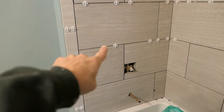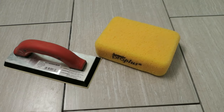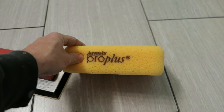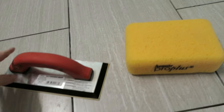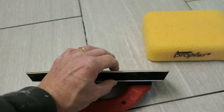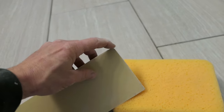For information purposes, this is a 1/8 inch grout line and I'll be using a sanded grout. If you have a thinner grout line like 1/16 inch or so, you can use a non-sanded grout. As far as tools: other than your five-gallon buckets — one with grout and one or two with clean water — you're going to need a grout sponge. Don't use just any sponge; these are specifically designed for this and can wring out almost all the water, which is what you want. My personal preference for applying the grout is this rubber gummy-type float. It's got a sharp edge, some gumminess to it — one end has a rounded-over edge and the other end has a sharp edge so you can get into corners if needed.